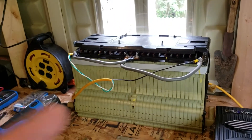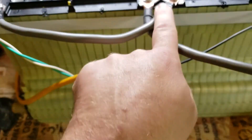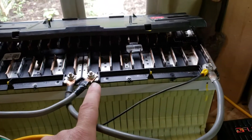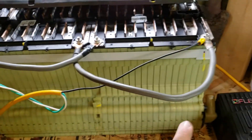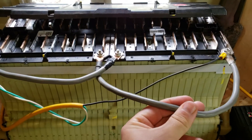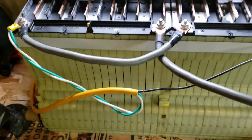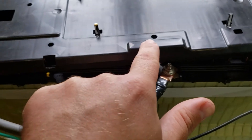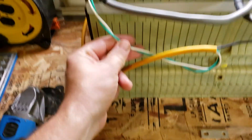Here's the other section — two 48-volt packs. I've got the lid off here. I removed the bus bar from here to here because these were wired all the way in series to give 86 volts total — 43 on each pack. I removed the bus bar and connected the two up. What I'll do is keep these lids for protection, take my die grinder and notch out one section, then pop the cap back on. But just for now I want to get some energy put back in.